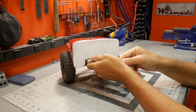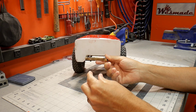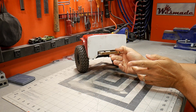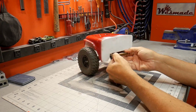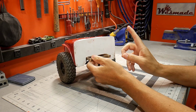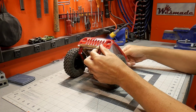The front, I need to come back and put some extensions on, and then come in and triangulate here, so that the tongue's going to be out, probably a good bit in front to give it a good turning radius, so that if you have a spare tire, it's not going to hit anything in the back. But all in all, it's coming together really nicely. So I think just focus on getting the tongue completed and possibly getting the hinges done. So let's get to that.